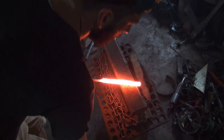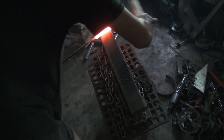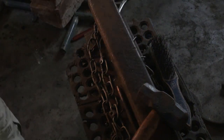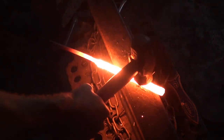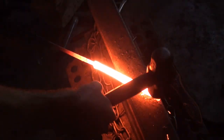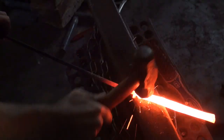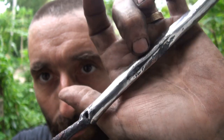Now I can't see any more strands — just a few. I did flux it in between those, I just didn't show that bit. I'm working the material as well, that's why it's getting thinner. We have just one or two lines left. I didn't grind them all away because I wanted to show you — there's one, and this is the only one I can get my fingernail in, but it will grind away. So it's one solid piece now.